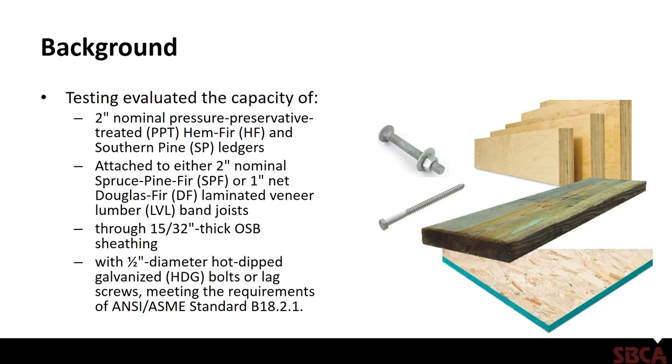For manufacturers in the north: spruce pine fir and spruce pine fir south are not the same — the specific gravity for spruce pine fir south is considerably less. This detail requires that the minimum specific gravity of the end verticals of the truss be 0.42 or greater.